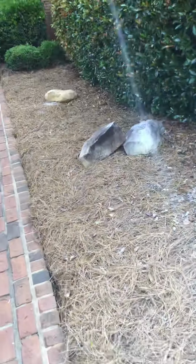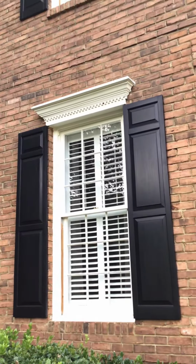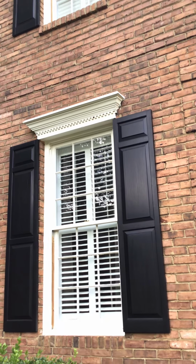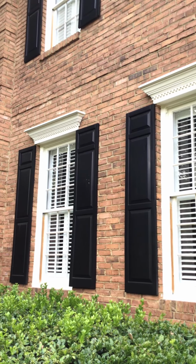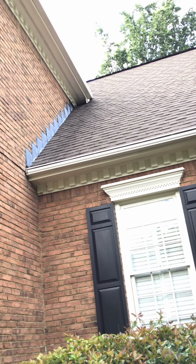Over on the front of the house, if you go back to the original video, we ended up rebuilding these pediments. Both were rotted. On this first one, we kind of broke a rule, we should have let that cure for a few months, but that top plate is custom beveled on both sides to make it look like the 2 pieces of wood that it replaced. It's actually pressure treated. And this one was rotted as well, so we added that into the job and replaced it. Because we were here, and James and his family were so good to us, we did that stuff for a vastly reduced price.